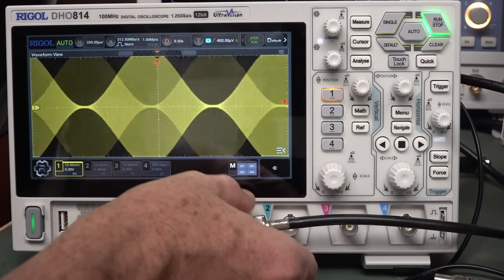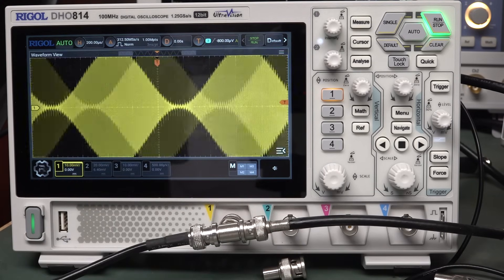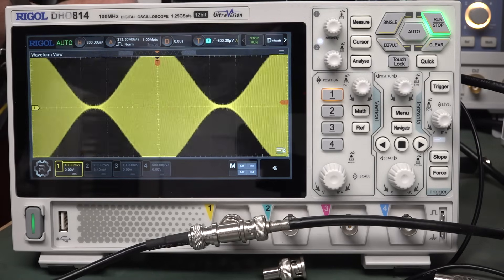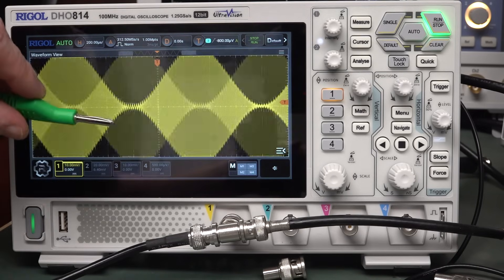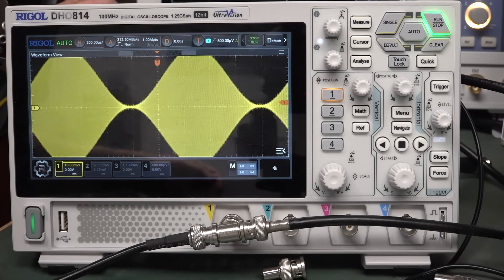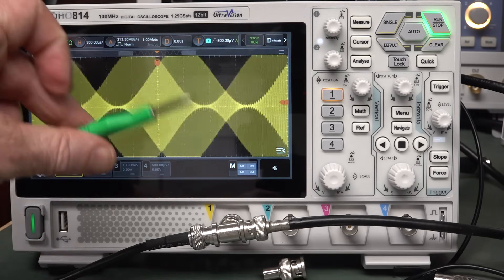Fascinating. That's what you can get if you get a dodgy ground. Mains earth — but it's still there. I can still see the high-frequency noise. With no ground, it's higher. But with direct connection to mains earth, it does attenuate that a fair amount.